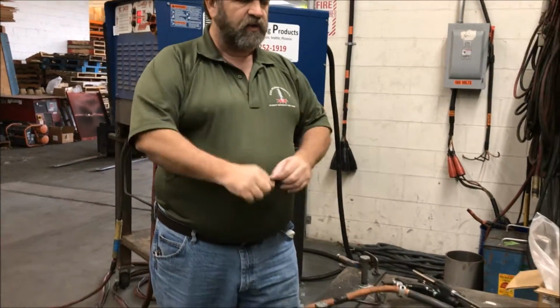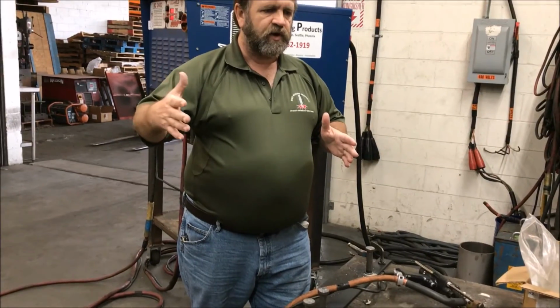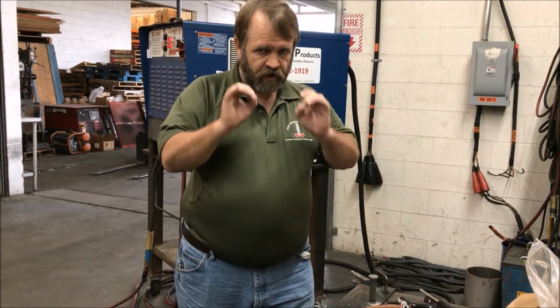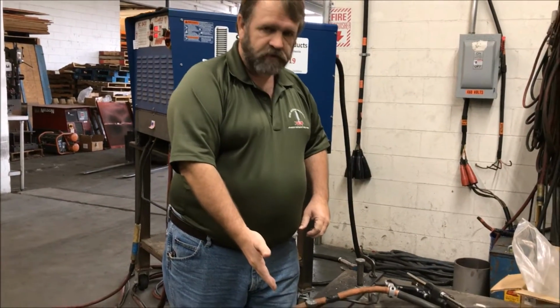Anyway, so if you hear that change at the end of the weld cycle, and it'll spatter like crazy too, you'll hear it and you'll see it. So what you want to do is just shave off enough time to where you hear that constant sound, right where it was about to begin to change. Shave the time back to that point, and you're at the perfect time, the absolute perfect time. Then check your results, obviously.